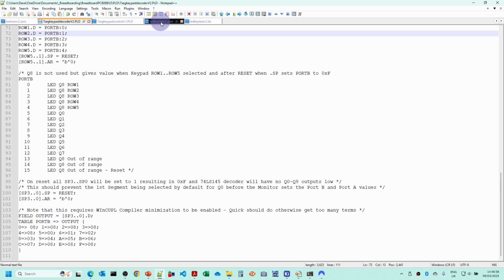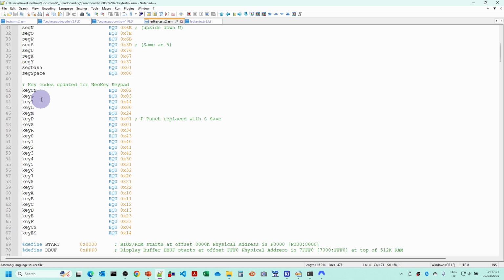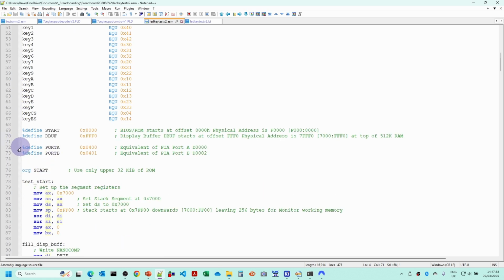Now let's have a quick look at the test program for this as well. I did cover this in the earlier video series. I'll include a link in the top right hand corner, and it will be in the description below as well. This is based on the original code from the Nanocomp monitor, which was updated to provide a test program. So I've updated the key codes here, which are now the NeoKey keypad codes. We're now only using the I/O port 400 and 401. Previously we were using memory mapped access.